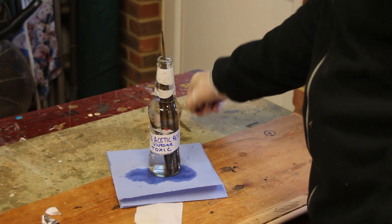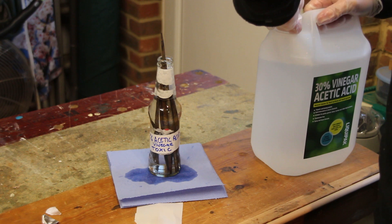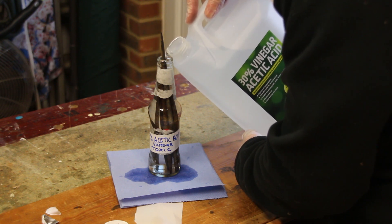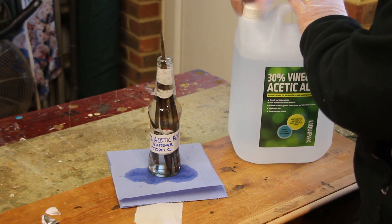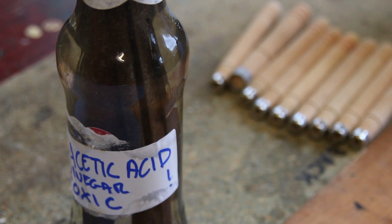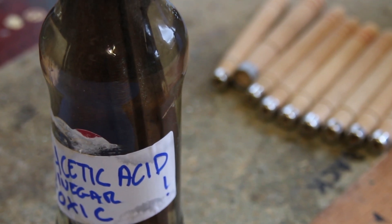On Amazon in the UK you can actually get 80% acetic acid vinegar, which says it's food grade — it's the same sort of price but you get a lot less. I'm using the 30%; I just think it's going to be a little bit safer to handle, but obviously when handling any acids you need to take precautions. I'm wearing eye protection and gloves. I've left this overnight — it's about 10 degrees in the garage, and these reactions do tend to be reasonably dependent on temperature, so I think they've had plenty of time to do their magic.